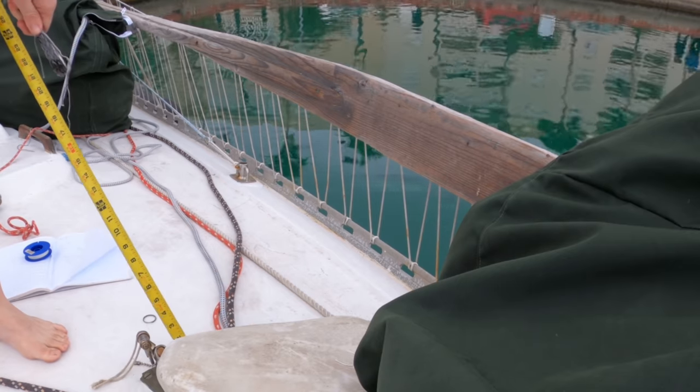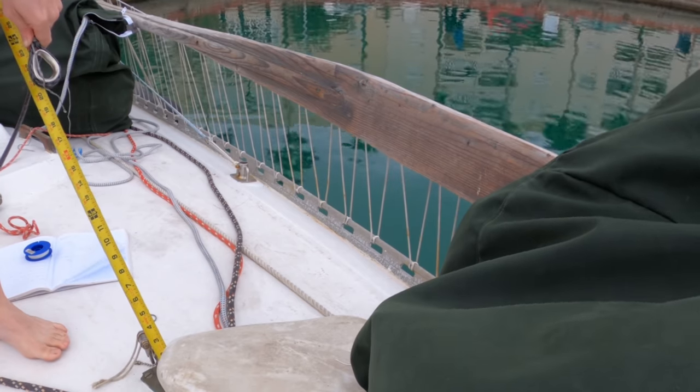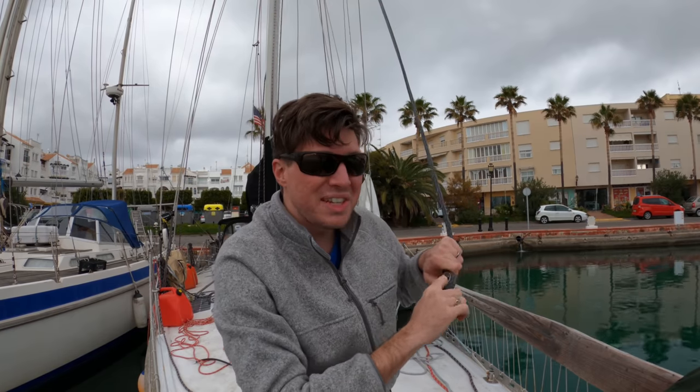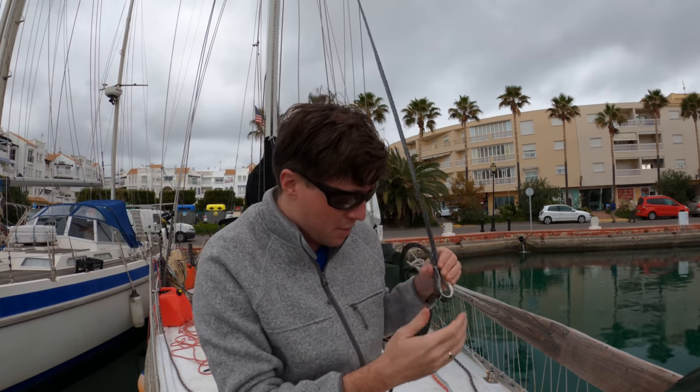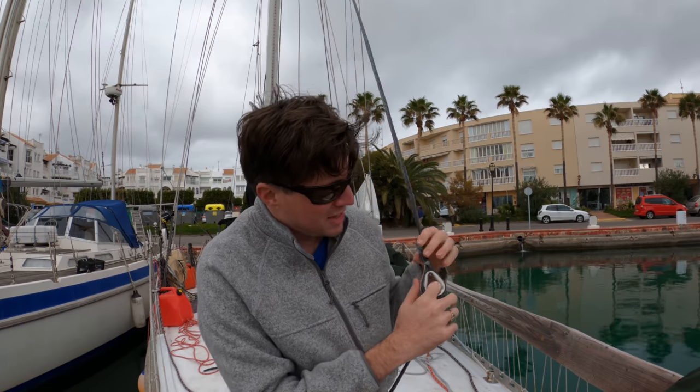Now's the moment of truth — we want to be within 24 inches. When I measure, I'm spot on at 20 inches. So we're four inches shy. The reason we're four inches shy is because I ran this up the halyard clipped into the end of the halyard — so you have all the way from the shackle up to the block and then beyond to the tang. This isn't really the most accurate way; this is more of a check for 'are you close or are you way off?' Being how we come out at 20 instead of 24, that's a four inch difference — pretty close. If we're off by a little bit, we can just add toggles to bring it up if we end up being a bit too short. But it's better to be close than way off, because now's the time to fix things with the knot, before anything irreversible happens.